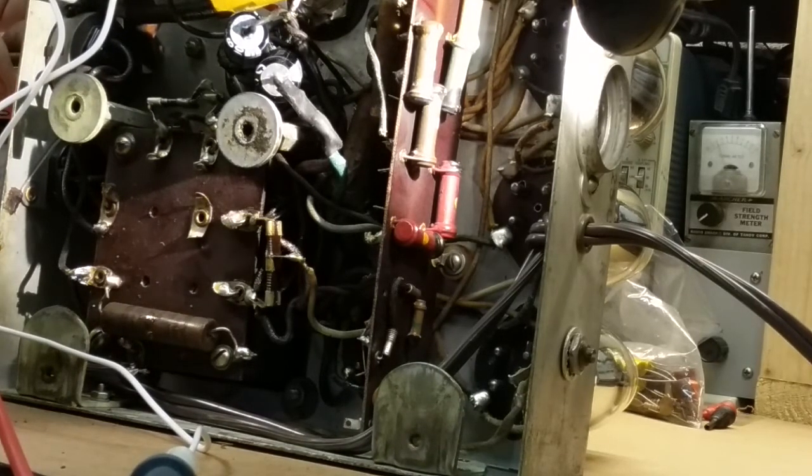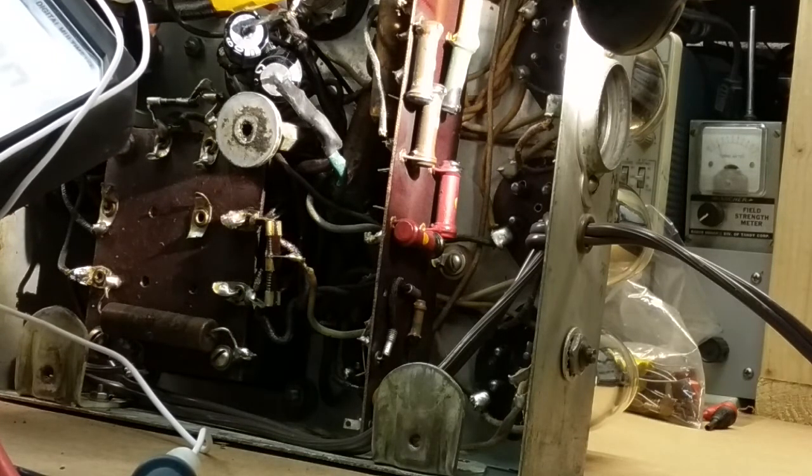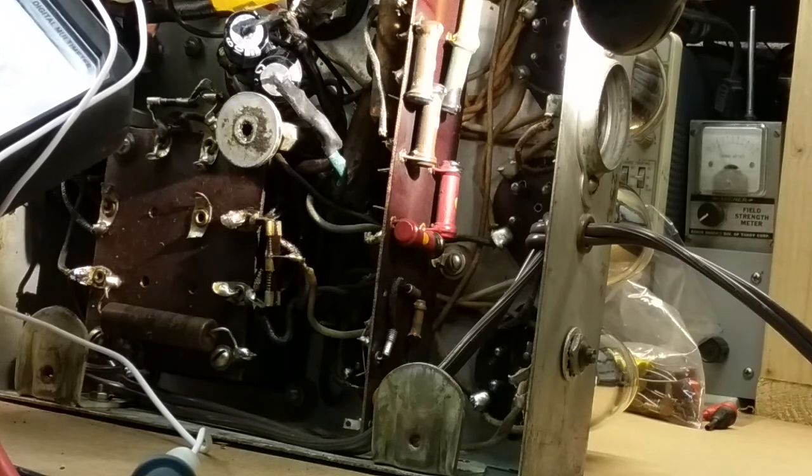24K, 80K, I'm turning it quite a bit, 160K, 250K. Great, the volume control is fine, and it goes up to 560K. It's still counting up, that's strange. It might be a capacitor across it charging too. Yeah, let's see where it stops at. 569. All right, 570K.